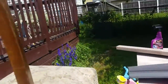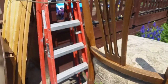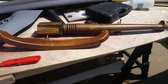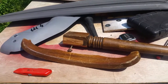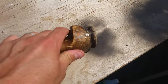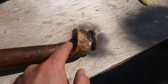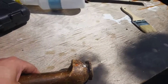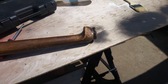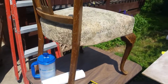I've been working on projects and I've already cleaned off where somebody used this rubberized glue — you can see where it's busted. I've been watching a woodworking channel on YouTube and he's shown me quite a bit of cool tips: one, using an artist's paintbrush when applying glue; and he taught about staining and gel. I glued this piece and it's not perfect — I can still see the crack — but it was mainly just to get it back sturdy again. This little piece right here where my finger is had come off. These legs were made up of several pieces put together, machined versus being milled. I'm going to put these table and chairs together, clean them up, and get them to match.